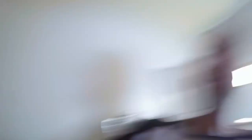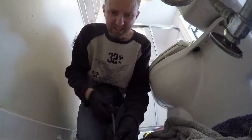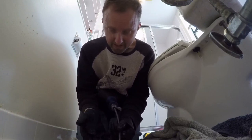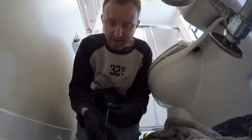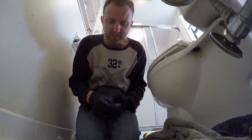I'm going to try and pull this back up and hopefully it doesn't get stuck. It's kind of hard to do with one hand when I'm holding the camera. I need to hold the gun with one hand and then work my way back. I'm going to put this down - if I find anything super gross that comes out I'll show you guys. I hope it brings up a big old piece of hair. If it's still broke I'm gonna be bummed - I mean what the hell could it be? If I did 25 foot through this pipe and it still doesn't drain, and the other toilets drain, it isn't the main pipe. Nothing even on it.